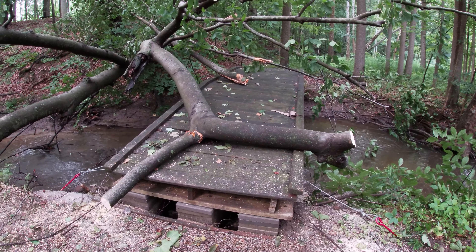Literally three days after I got it done, this tree came down. The way I built this bridge, it's built like trusses. Everything is built out of treated wood, and I built all these trusses in my barn. The whole bridge was actually prefabbed — I built all the trusses, all the deck boards were pre-cut. All I had to do was pull it down here, assemble all the trusses, stand them up, get the decking on it. I think I can save the bridge. There's a lot of weight on there and it's still holding up.